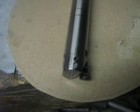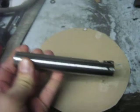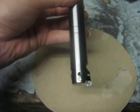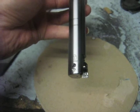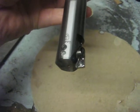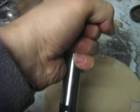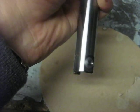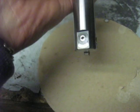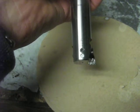I'm trying to show an interesting tool here. You can see it in my hand — it's worth at least $1,200, it's not mine, I'm just making a little video. It's an adjustable boring head for a mill. You grab hold of it in the mill and it spins around and bores out whatever you're boring. It has a one inch range, so about seven eighths to about inch and a quarter.